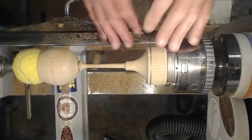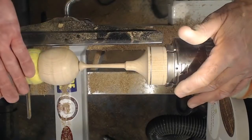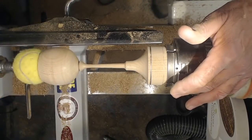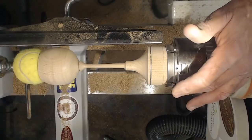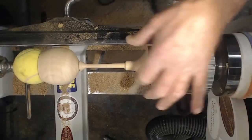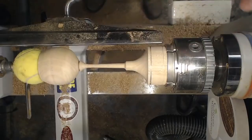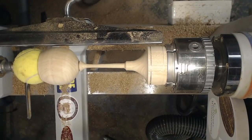So what would happen is that you've sanded the whole piece. The next stage would be to put sanding sealer on, Yorkshire grit if you wish, and then the wax of choice, which in my case is Hampshire Sheen. So that is really, I don't know how long we've been going, an hour and a bit, an hour from start to finish, and talking in between. So I'll just stop now for a minute and see if you have any questions.